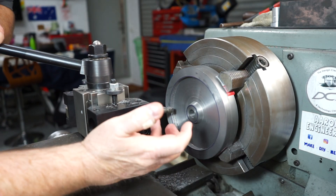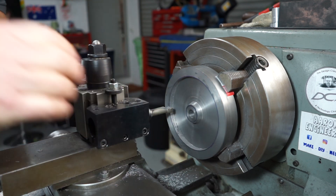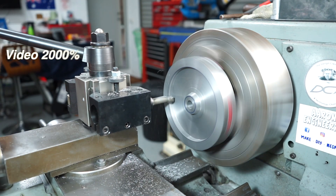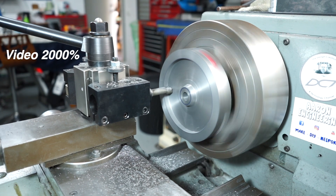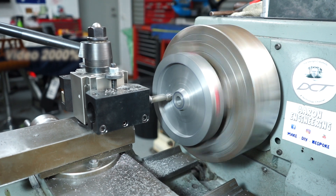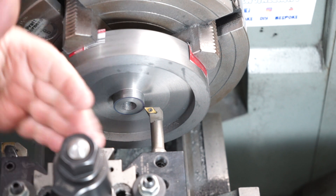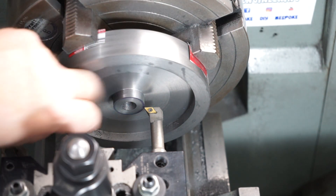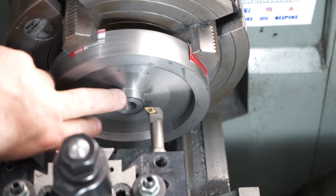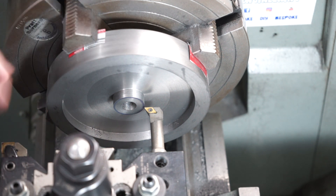It's running fairly well — there's a slight jitter and deviation in the needle but it's definitely under 10 micron, probably around four or five micron runout, and I'm not too worried about that. I'll face this side down to 30 mil and then do the channelling internally. I'm boring this diameter out to 130 millimetres. This little boss here has to be 30 millimetres; I'm using the compound feed to control an accurate measurement without the risk of blowing it out.